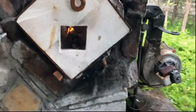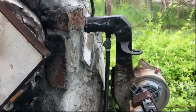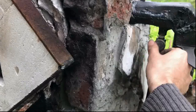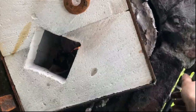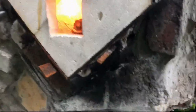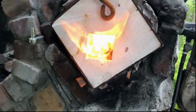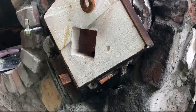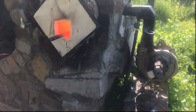With the baffle pushed in, there's not much airflow. In the past when I've used gas forges I've turned on the gas first, then the air, so that's what I'm going to try. That doesn't seem to be going — I'll turn it off, get a little bit of air, then try giving it some gas to see if it lights. Well, it seems to be working — there's definitely propane burning. The gas forge seems to be working pretty great.